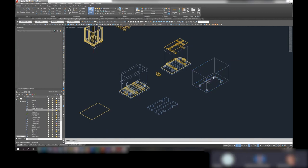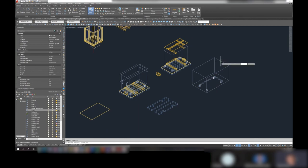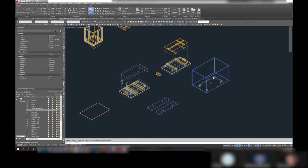You get what I mean? Sometimes the machine mounting is actually inside the frame only, but the machine body is so big. So for the floater, some people will try to squeeze the floater until it's tiny, then we got problem. Because the machine is so heavy and so big, but the floater mounting is so small, the foam is not enough to take the weight.